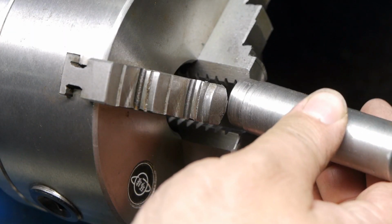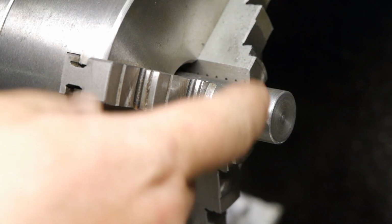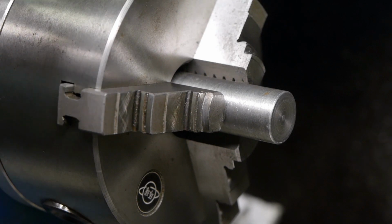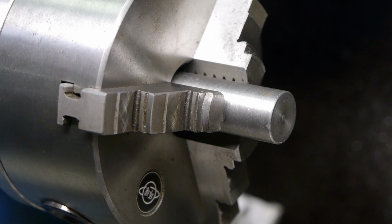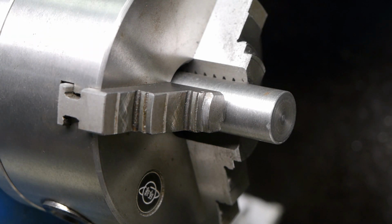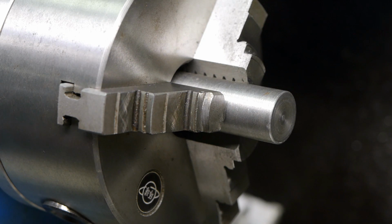And the good thing, or the cool thing, the outside diameter is only 1/10 of a millimeter thicker than I was planning. So I guess I can basically continue where I had to start over. How about that? Sometimes you do get lucky. Next I'm going to polish this up a bit with some emery cloth, and then I will part this off somewhere.